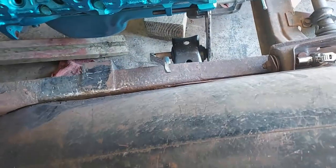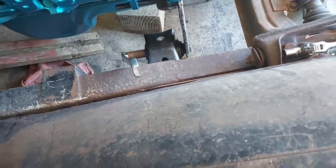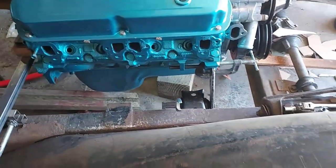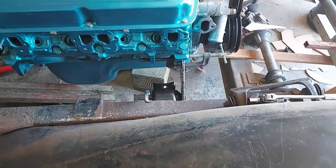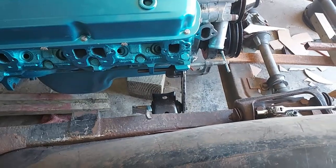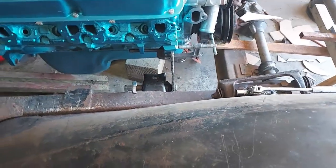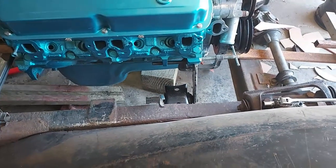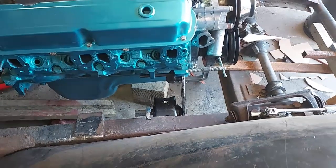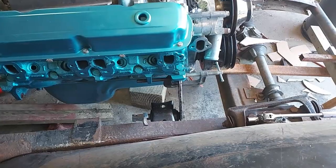So this is a 1/2 inch bolt down in the bottom. These will be smaller. I don't know what they'll be, 3/8 or something. But anyway, I'll drill the holes the same size as the block. I don't think that's all the way to 1/2 inch because that's not my biggest punch. So let's punch that thing and see if we can get a hole drilled.